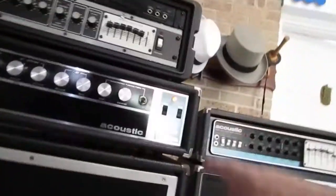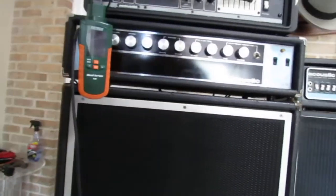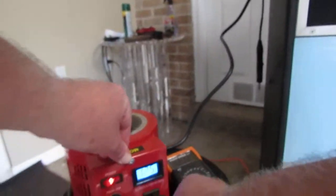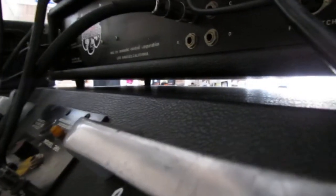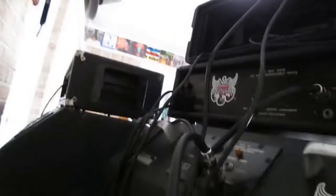I'm going to power this down, unplug from the Variac, and convert over so you can see how this other part works. I'll put my camera on my head. One thing to note — this amp has a two-prong plug, which is another thing I need to fix. They just didn't do a lot of grounding back in the '60s, and this is all original. I've already been 'lit up' a few times by it, as has happened with some of my old amps in the past.